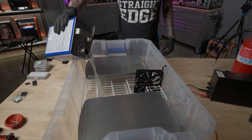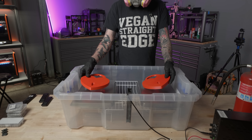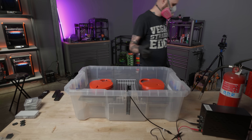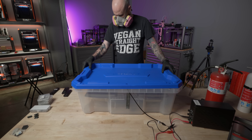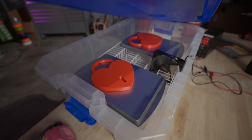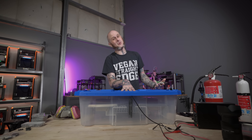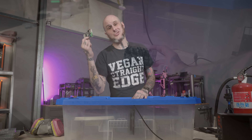To start smoothing, we need to get some acetone into our chamber. It's not going to take a lot, just enough to start filling up this chamber with vapor — it's not the liquid that's doing the job, it's the gases. After 15-plus, probably closer to 30 minutes in the chamber, the first two I'm trying to do really haven't smoothed out, and I've got 48 more to do. I could probably leave these in here overnight and they'd probably be great, but I don't have time for that. So we're going to get drastic.